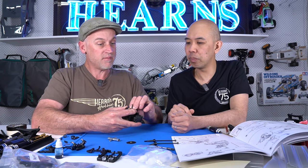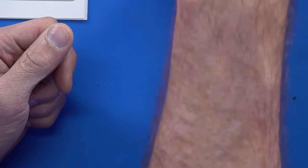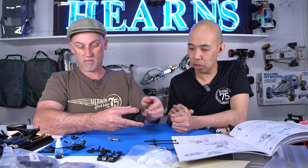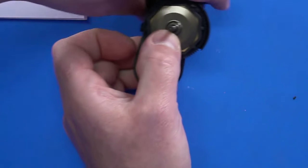So we'll put this one in. Yep. Is there any washers or shims in there? No. Good. Nope. So once you've got that all together, I'm sitting this one in and then the top pressure plate. Yeah. So you get your pressure plate and then you get your spring, which you're going to pre-tension. Are you going to tension that up? Hold that, make sure it doesn't pop apart.